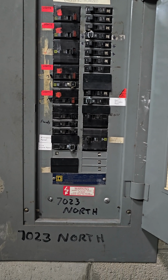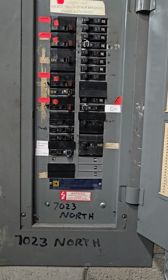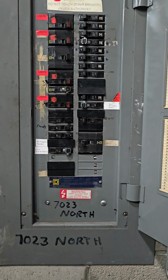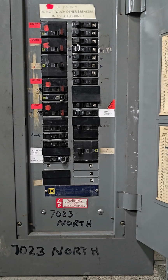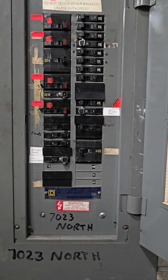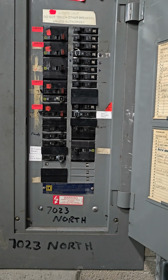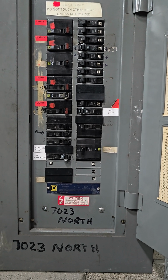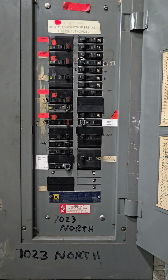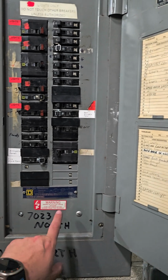So then, of course, we had to call Will Surge Electric, our guys that we use for electricians, and they had to send one of their service techs out, and he's like, yeah, we've been having problems with the meter over there. The meter socket on the B phase is not connecting on the back of the lugs. We ordered a new meter case about a year ago, but then kind of forgot about it, and I'm like, oh man, come on. I'm like, whatever. So we have to schedule a shutdown at this building where they're going to lose half the building of the power, because phase B on one of the meters is down.